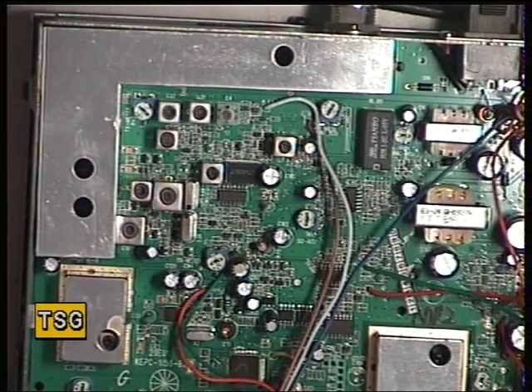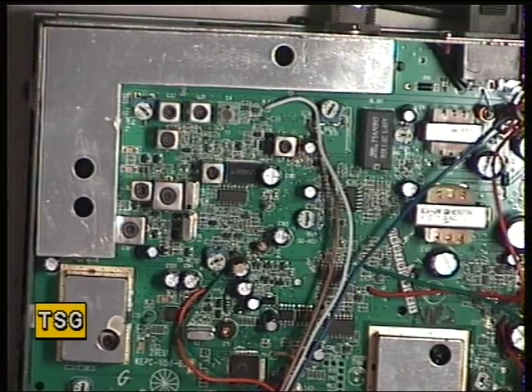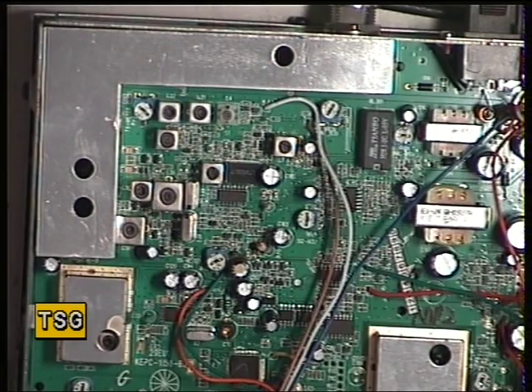Now I've optimised it. The manufacturer says it's less than one microvolt — well, we've got it down to 0.06. That's for the 10 dB sinad. Reading the attenuator: 0.15, 0.2, 0.25, 0.3 — then 1.0, 0.9, 0.8, 0.7, 0.6, 0.5. Not bad.